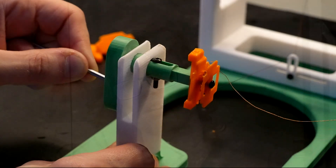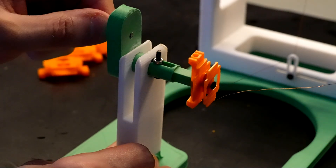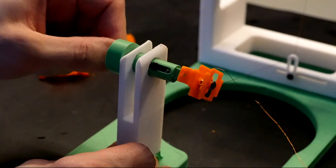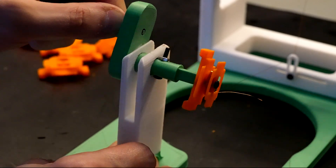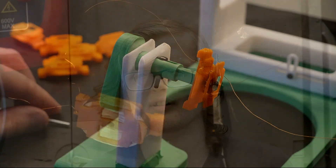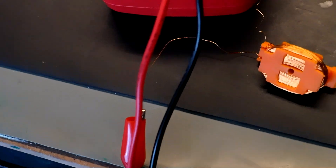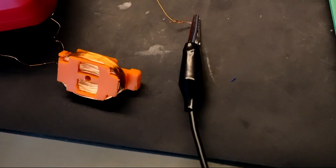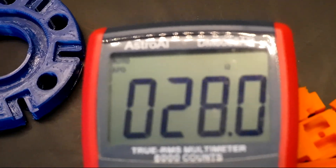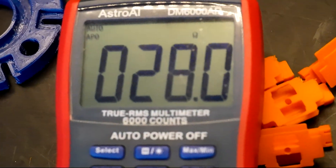For each of these coils I was able to wind 800 turns of 0.2mm wire, and on measuring the resistance I found each coil has approximately 27 to 28 ohms. When I was done winding each coil I could utilize the cable management slots — a feature I introduced in the V3 design — to reduce mess and decrease the risk of tangling and the wire getting caught in the rotor, which was a problem with the V1 generator.